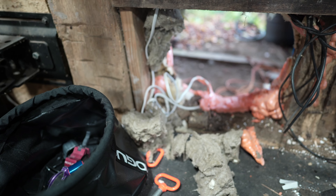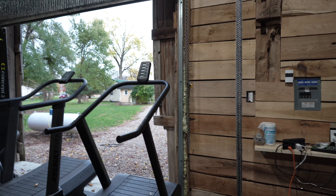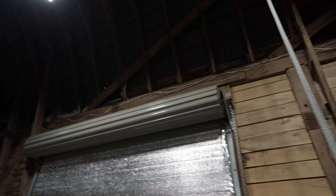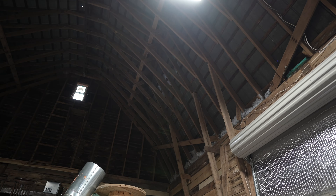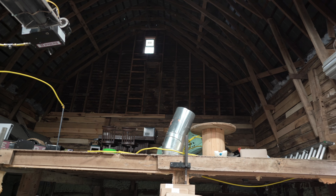The heater is moved and now we've got to deal with all this — the electrical wire kind of circles back around to that wall over there. I took all the wire back around the walls and pulled it out from underneath the mats, but now I need to snake that wire all the way up this wall right here — not down, we need to go up that wall, over top, and then down. I'm going to put an outlet up there, and I also need to hang a light up above so the loft gets some light. Everything that needs to happen right now is getting the wire routed to where it needs to be so we can get power where we want it.